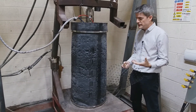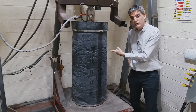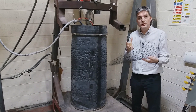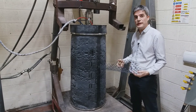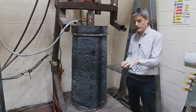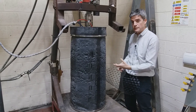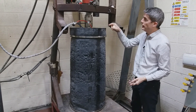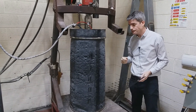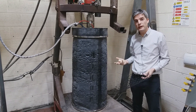The whole idea of this is to test the material as a single composite. Rather than testing the soil on its own and testing the geogrid in air on its own and then putting the two together in an analysis model, we test them all together. We are testing the mechanically stabilized soil — the effect of this geogrid on the aggregate. Once the specimen is set up, we apply an axial force, a deviatoric stress, and measure the displacement to get the full mechanical behavior: the stiffness and the strength of the material.